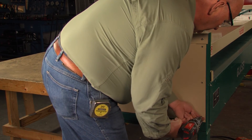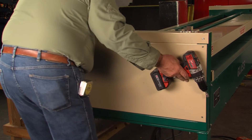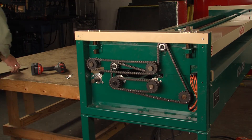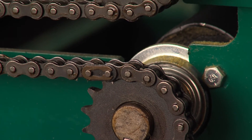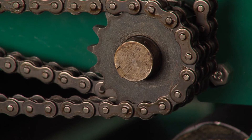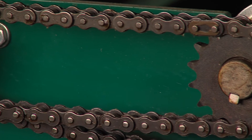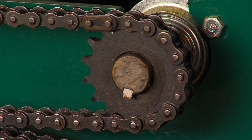The drive mechanism is located on this end of the machine. By removing six screws, you can see the design — the machine is very simple to maintain. The newer machines all have key ways and keys that lock the shaft and sprocket together. Some of the older machines had sprockets attached with set screws that sometimes loosen and cause grooving problems. If you have one of the older machines, this can be corrected by using a thread-locking type solution when installing the set screws to keep them from loosening.